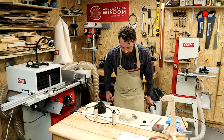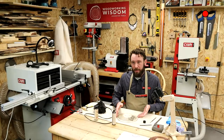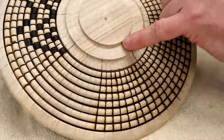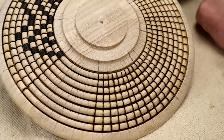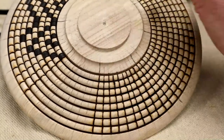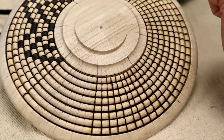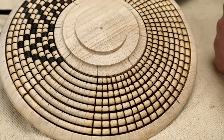Okay. So first things first, there's a little bit of pyro left to do. So let's come in on camera two here, Steph. That'd be great. There we go. If you remember yesterday, this came off the lathe. It still has its little sacrificial foot on it, and we've got some pencil marks on there because we're going to rechuck this and get it on those big wood jaws or the button jaws, and we're going to remove this foot, and that gives us a chance to sand this area as well. We have our pencil lines, which Colwin kindly put on yesterday, using that flat table and using the indexing on the lathe spindle.